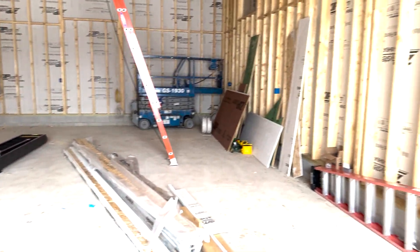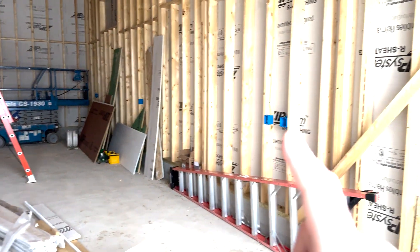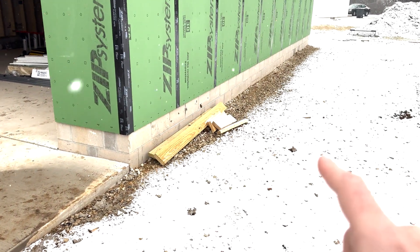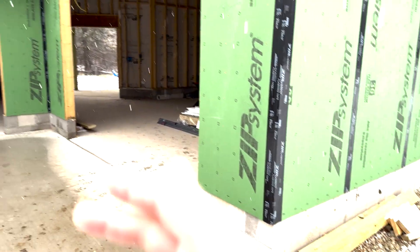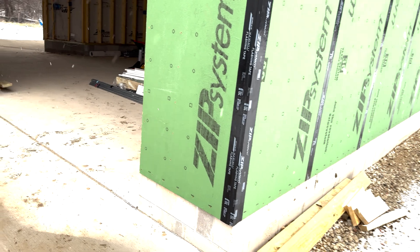Now let's talk about high-amperage outlets for the rest of the garage — whether you're a welder or want to install a washer, dryer, or other high-amperage equipment, locating those circuits is critical. Here is where my welding outlet is going to go, feeding back to the main panel. We're also running to the outside — there will be an RV plug here, 50-amp capable, so a friend with an EV can charge using their mobile charger without pulling into the garage, and you can also plug in an RV on the pad outside.